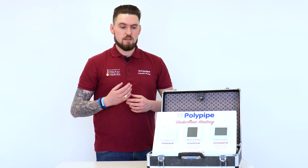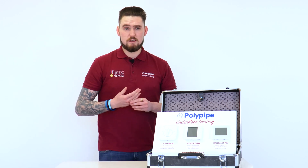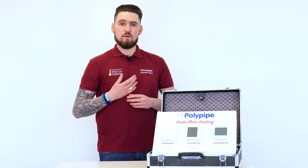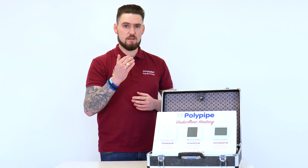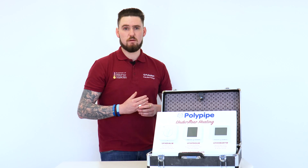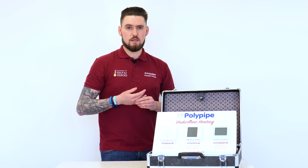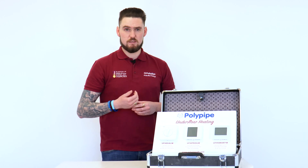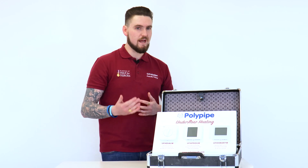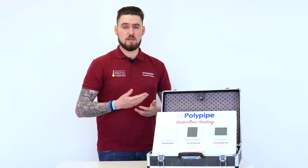So there are pros and cons to different systems. When we're talking about controlling the system, it's very important to mention something called setback. With conventional radiator central heating, we've never really done this, but essentially setback means that during an off period, rather than letting the system temperature just drop, we maintain a setback temperature of usually four degrees below our comfort level. This means when the system needs to return to comfort temperature, it only has to climb four degrees rather than ten, making it more energy efficient and faster to heat the property.